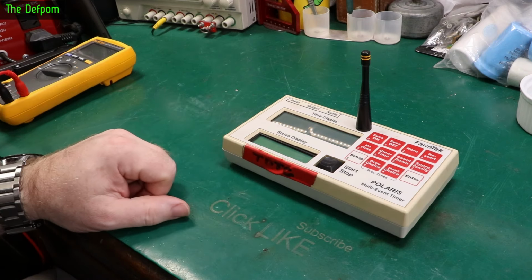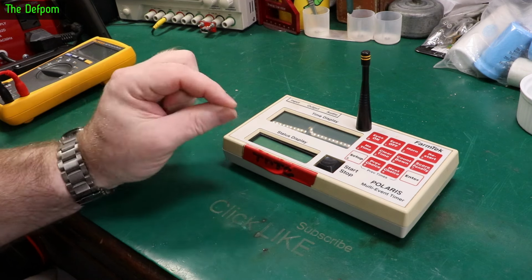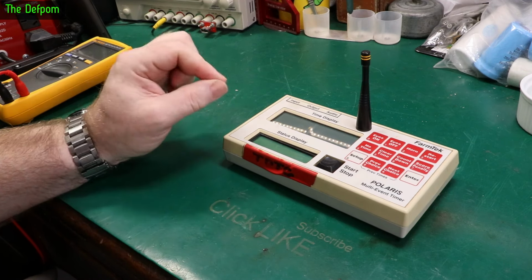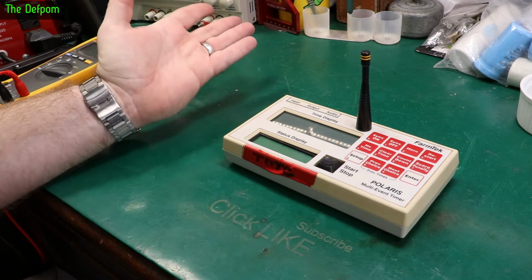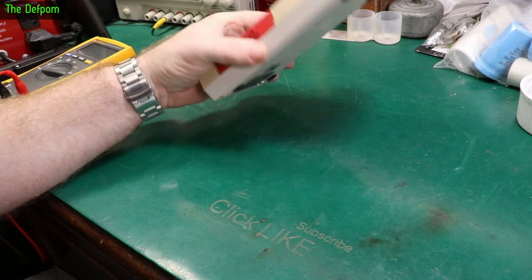With battery corrosion issues, you have to be really thorough trying to sort those things out. As you saw, the tiny little bit of corrosion on the resistor, which you could easily miss, was causing you a problem. So if you don't thoroughly inspect these things, you can easily miss a problem, which is going to be quite severe. I mean, that's a really small resistor. It's a 0-ohm resistor, which I've now lost. It's on my desk here somewhere. There it is. That's a resistor.